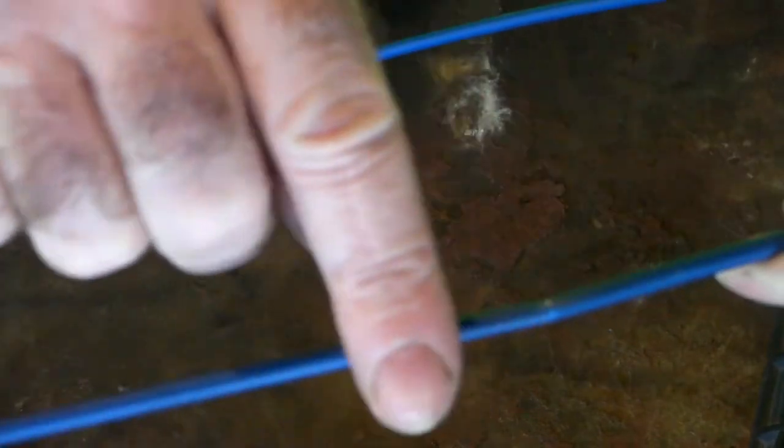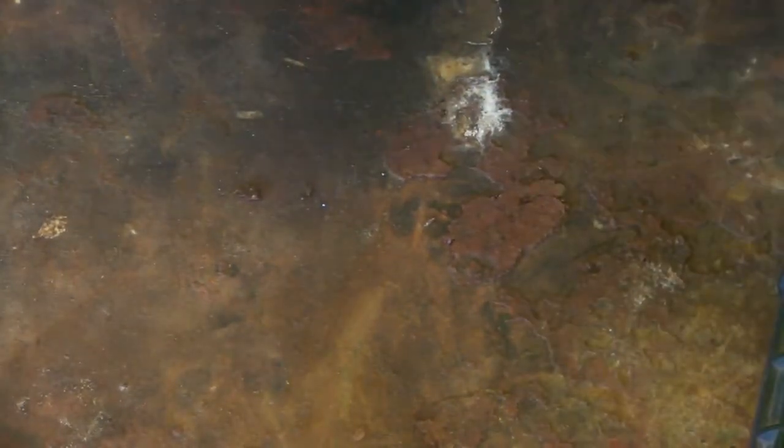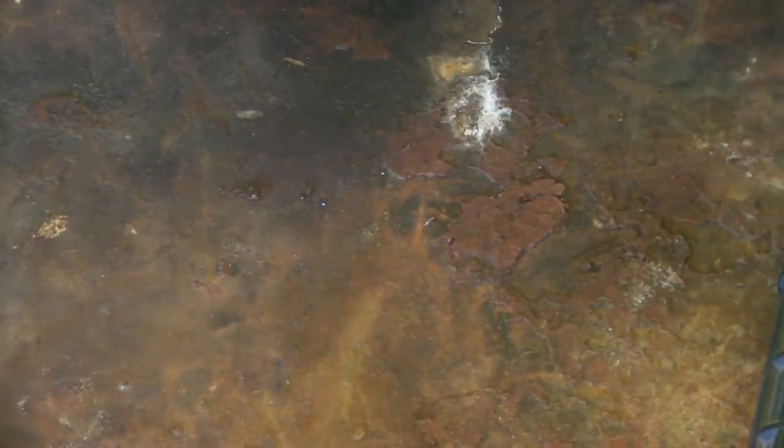See this liner here, it's got a kink in it. That's just what I was talking about before, when you've got it wrapped around something and you're welding and it gets a kink in it. Then when your wire runs up the inside of it, it catches here and doesn't come out of the end of your gun properly. So for the sake of $10, I'll put some links down below for these liners. Get yourself a new liner and save yourself a lot of hassle.